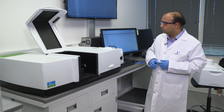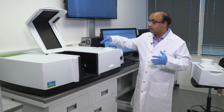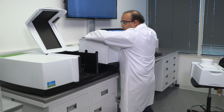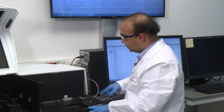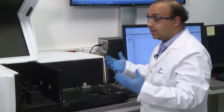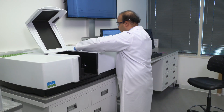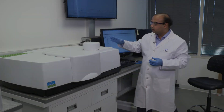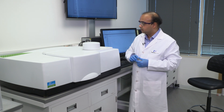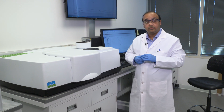The Lambda 1050 is a modular device, which means it is possible to exchange detectors. I'll show an example of changing from a 150 millimeter integrating sphere to what we call a URA — universal reflectance accessory — used for making specular measurements. We lift up the integrating sphere, which exposes the detector area with pins. As soon as we drop a new accessory in, these pins communicate with the accessory, instrument, and software to identify what kind of accessory has been inserted. The URA drops in and sits right in place — it is capable of measuring up to 3.3 microns.